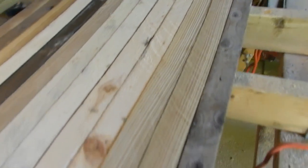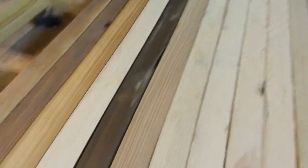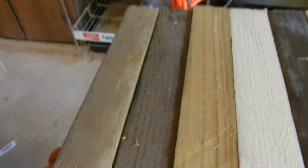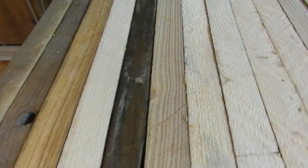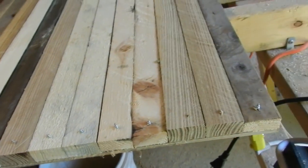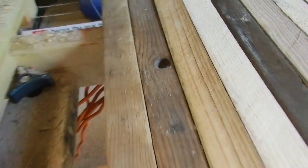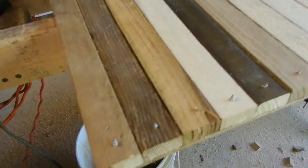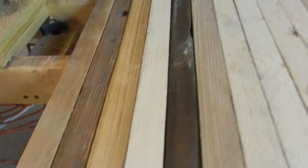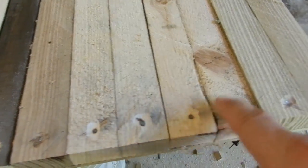Remove all the clamps and put your tools away. This has been turned over, and you can see the piece of wood underneath. These protruding screw ends have to be filed down or dremeled down — there might be a couple on that side too that are pretty sharp. All the wood is not level, so you'll need a belt sander or some kind of sanding to make it all level. Dremel tools make it so easy. You should be able to put your fingers over it and not cut yourself, especially if this is going to be a display for kids. Make sure you catch all the little metal pieces in a bucket — you don't need that in your foot or tire.